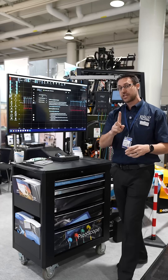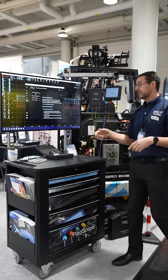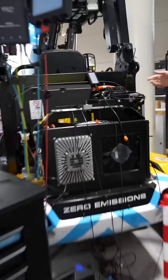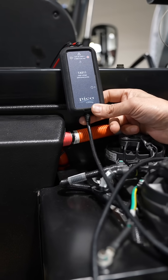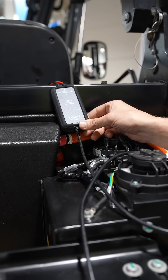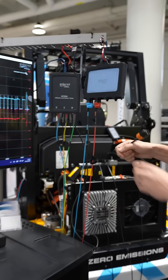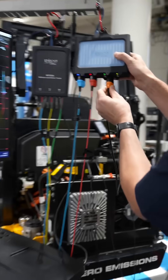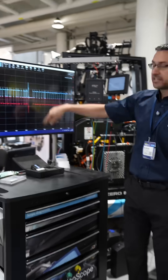We're just interested in having a single channel measuring CAN so we can potentially decode on it. The high voltage differential probe can do just that. All we're doing is looking at the difference between the positive side of the lead and the negative — and the beauty of BNC plus is that it's just plug and play, so we can just attach in.